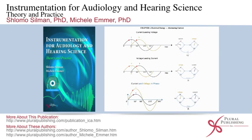Recall that in Chapter 4, we described a phasor, also called a phase vector or a rotating vector. The phasor represents a sinusoidal signal, that is, an alternating signal. The height of the phasor represents the amplitude of the signal, and the phase angle represents the angle made by the phasor with the horizontal axis at time zero.